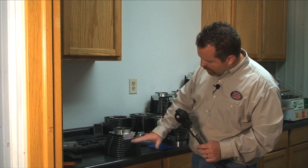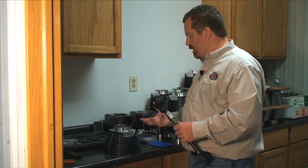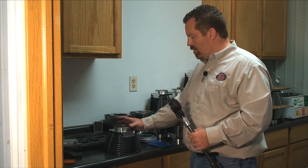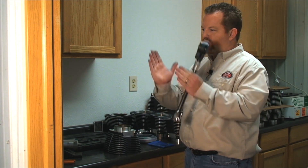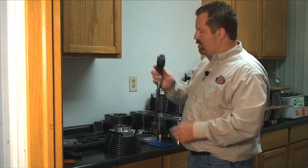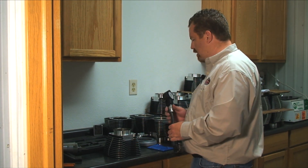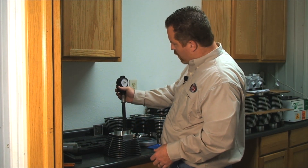When you're actually checking a cylinder, if you just did one measurement and walked away you wouldn't get a true representation of the size. You need to check it at different levels and in different directions. Not only will that give you the true size, but it'll give you what we call the total envelope — what the cylinder is from roundness, straightness, and taper. A cylinder could measure correctly in one direction but actually be banana-shaped. If you don't check at 90-degree angles you won't catch that. So it's important to check in multiple spots and multiple locations.